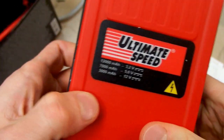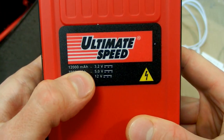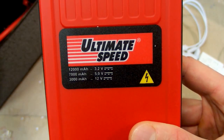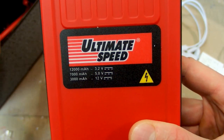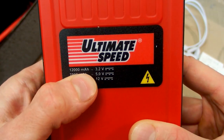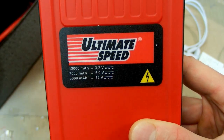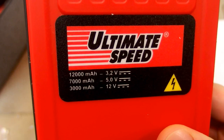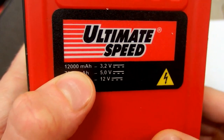As you can see it has several different ratings on it — several different capacities — because those capacities are in milliamp hours. Those milliamp hour ratings don't really say anything about the energy in the battery unless you know at which voltage it's measured. The energy in milliwatt hours or watt hours stored in the battery is basically the charge in milliamp hours times the average or nominal voltage of the battery.